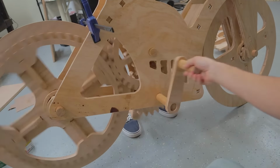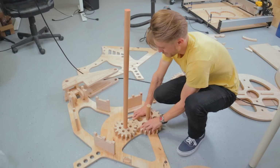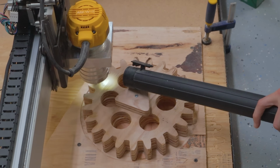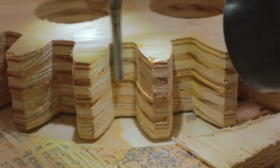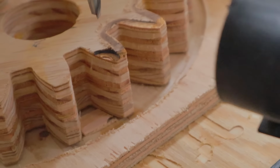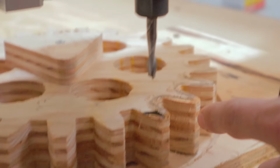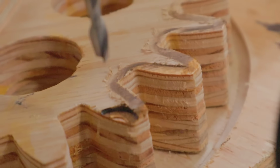We had a little bit of a disaster trying to get the two smaller gears that go from the first stage, that is the pedal, to mesh properly. We had to rejig them on the CNC and trim out a little bit of their diameter, and that was a pain in the butt. We ended up crashing the machine too, like three times. This is why it's important to make sure that your tool is far enough down to cut the entire face. Kind of smells like popcorn.